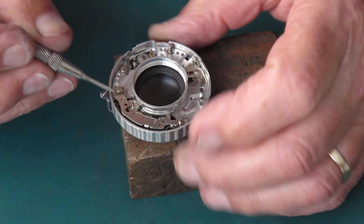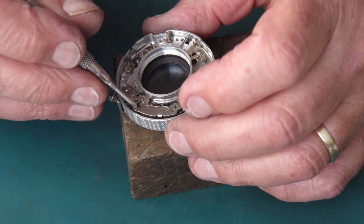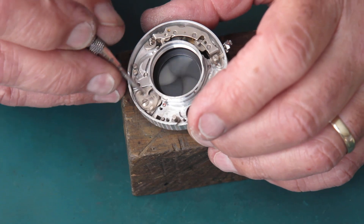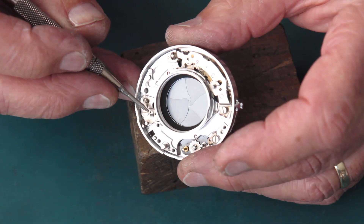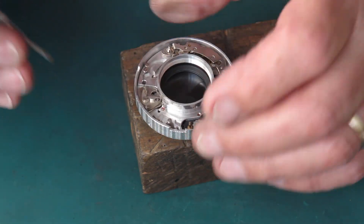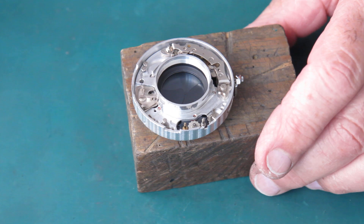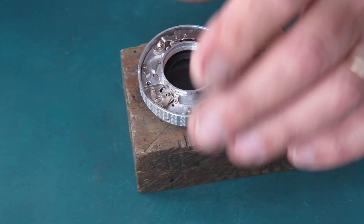The retard gear train has been flushed out with naphtha repeatedly and lubricated with graphite powder, and it runs very nicely. So the shutter is nice and snappy in its action now, and the shutter blades look somewhat better than they did — not so marked. The marks were only superficial, just an oily haze, and it cleaned away quite nicely.